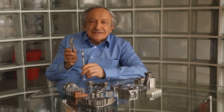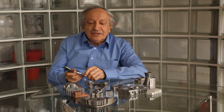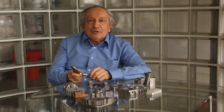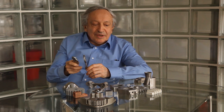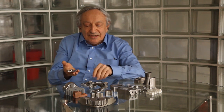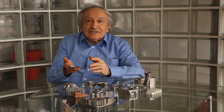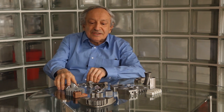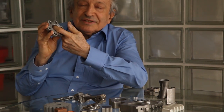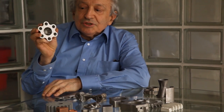There is a category of parts where metal 3D printing brings enormous benefit. The benefit is proportional to how much internal feature or internal structure there is in a part. If a part is without internal structure, you can clamp a plate, CNC machine it, and you're done — this works for any metal, plastic, or ceramics, and it's very cheap. But the moment a part has some internal features — like if you look inside and there are undercuts you can't reach with a tool — if you want a good finish, you have to go to investment casting.